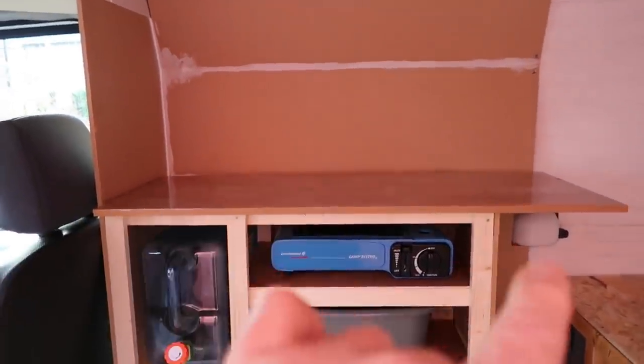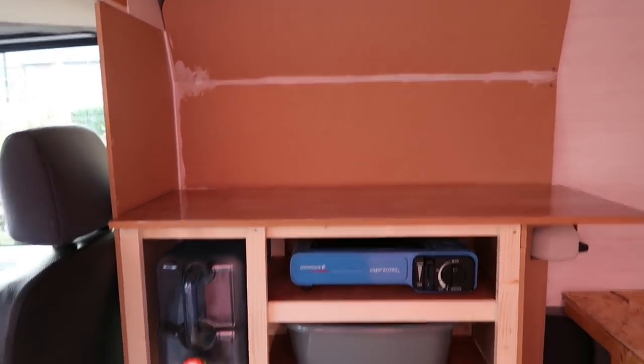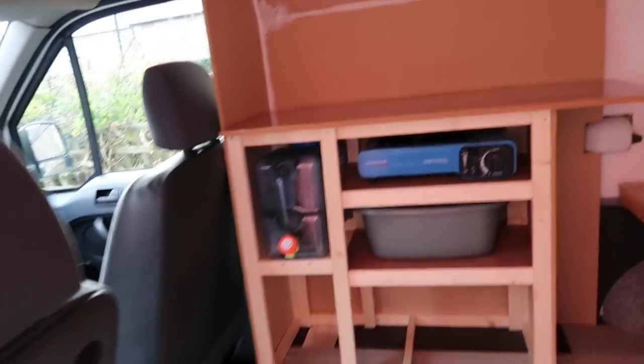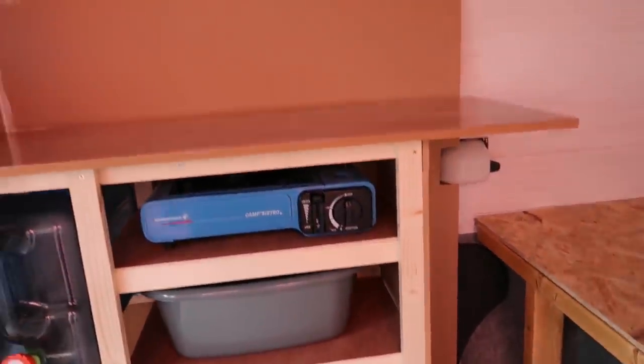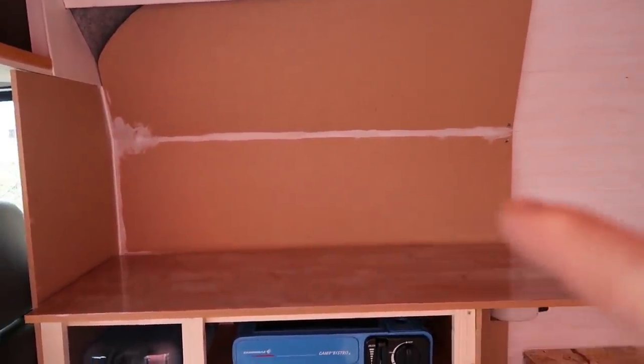What we're doing now is sealing the top with some PVA glue, and then we're going to put some tiles on the top here which we've purchased today. Jade's opted for some nice plain white tiles. That's looking quite sturdy and secure. We've also filled in some gaps along here to keep it tidy, because we're going to do one layer of tiles on the back as a splashback and then it's going to be painted for the rest. So that's been the day - we'll catch you again in the morning. Tomorrow we're going to be doing some tiling and Elaine's covering the foam for the bed.